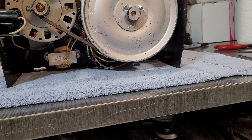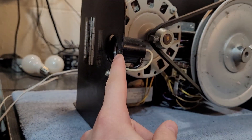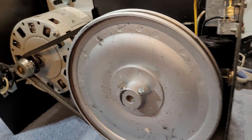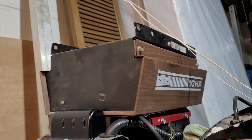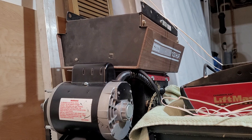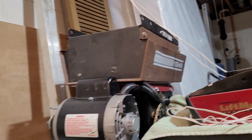The first thing you need to do is take your cover off. There's a couple different ways. There's either going to be two screws, one on the front and one on the back — just quarter inch screws — and there's also going to be in these slots here, little tabs that fit in there that you're going to have to bend off. Or it might just be four bolts, and the case will drop off with a little bit of maneuvering — otherwise it's just four three-eighths inch bolts.